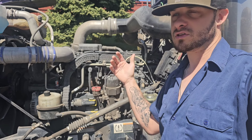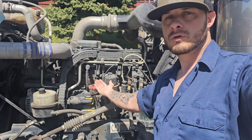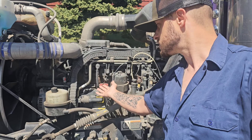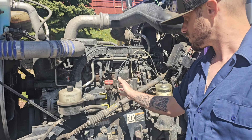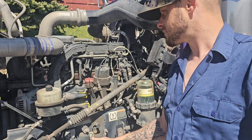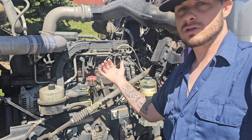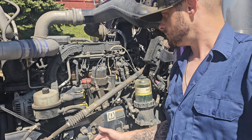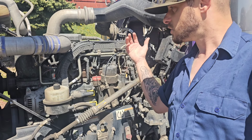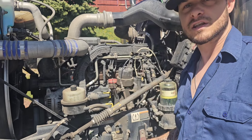What can also happen is oil or coolant leaking out of the side, not from the combustion chambers — not as big of a deal, because a head gasket repair is a very intricate repair. It might be leaking down the side of the block and could still be driven. But I don't see any oil or coolant leaking on the side, so there are a handful of other things it could be besides the head gasket.